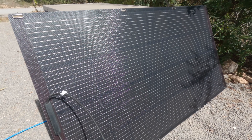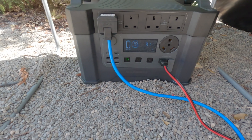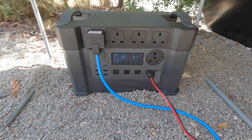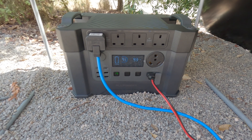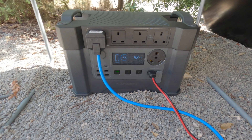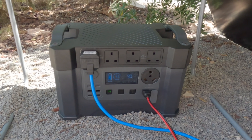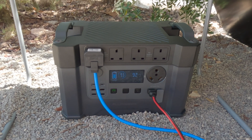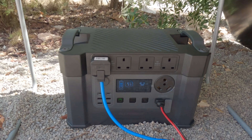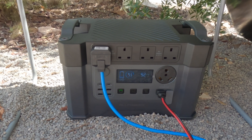The 200 watts is meant to be coming in right now. As it stands, we've got full sunlight and we are only bringing in power — not pushing power out — and we're only getting around 92 watts. That's sort of half the efficiency it's rated at. It was a little bit more earlier, but there isn't a cloud in the sky, so to me that should be bringing in more.